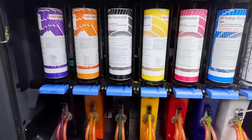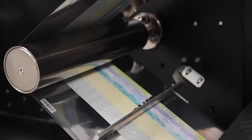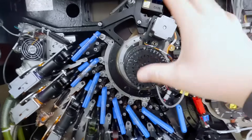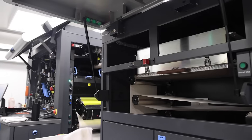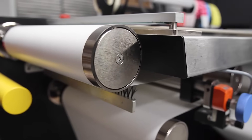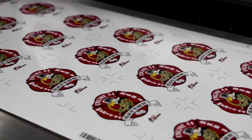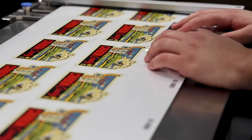When we use silver or clear material, we use white ink. The ink system lays everything down onto the drum, and an electrical charge transfers it down to the substrate running through the machine. Everything gets held into place — similar to how an electrical current grips your hand. This means every label or sticker gets printed with perfect registration, no movement, no fuzzy look. Whatever art file you send us is exactly how it's going to print.